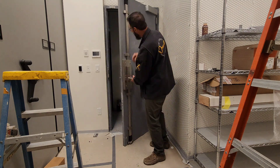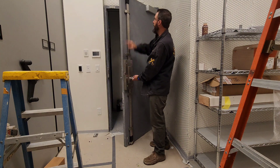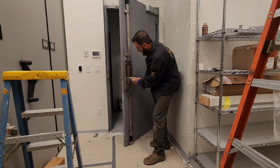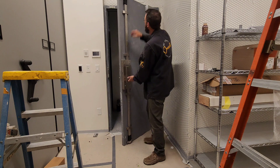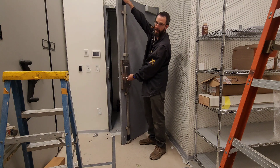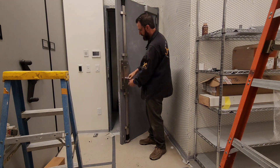So if I pull this door open and I touch this, the bolts fly out — up, out, and down. I then retract the lever and the piece up here is a friction piece that holds everything in. So everything is controlled by this top piece.